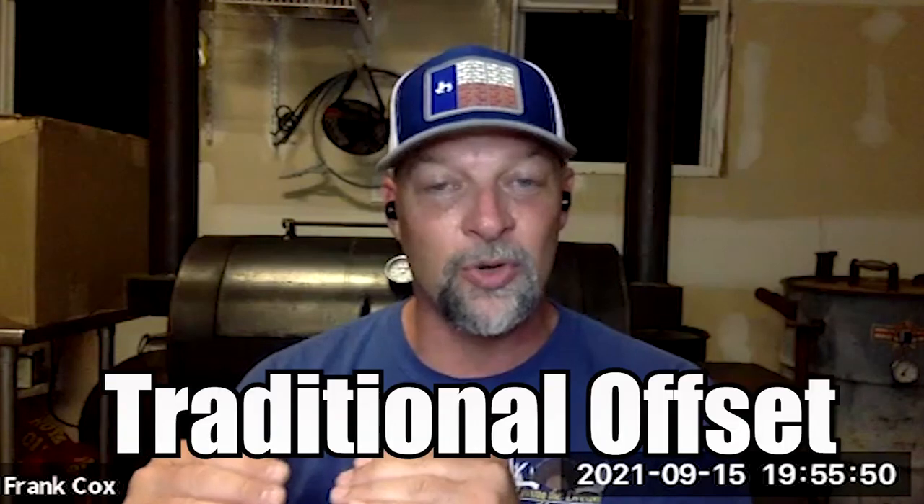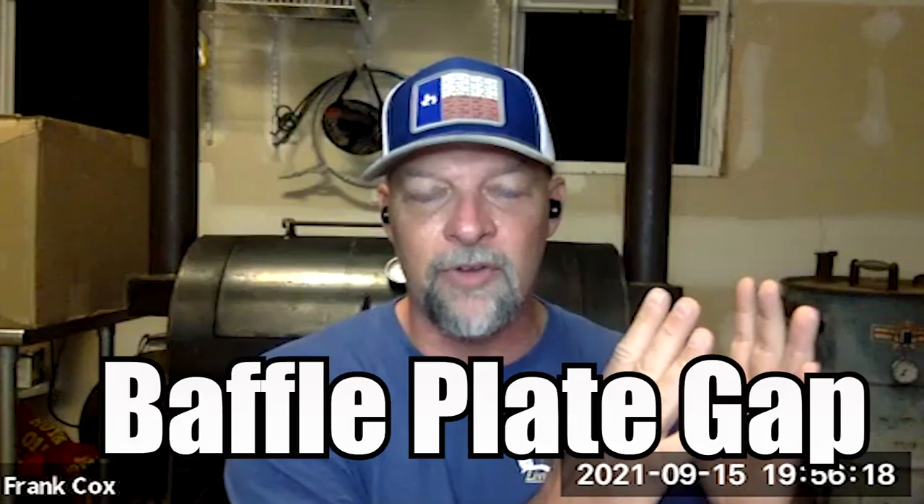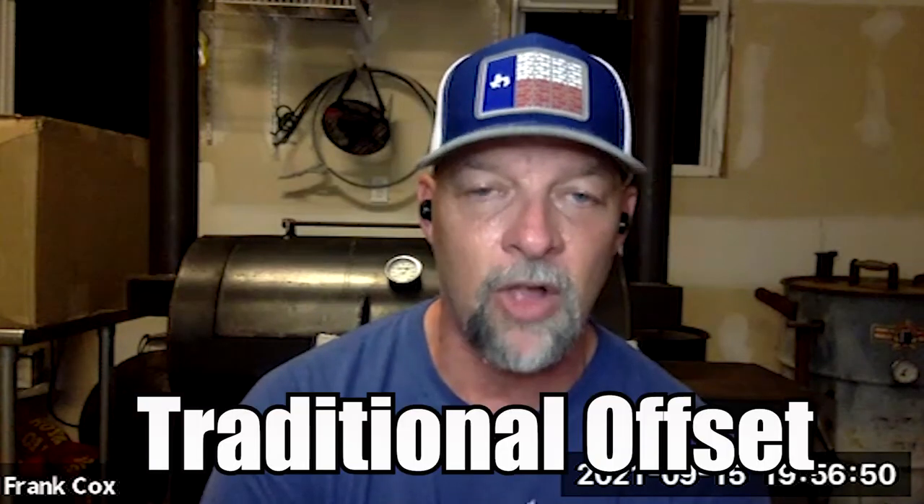In a traditional offset — there's open offset, which is what everybody's building right now, but there's old school traditional offset, which is a combination like the hybrid behind me. We're keeping that air mass below the cooking grate when it comes out of the throat, and we have tuning plates in there that are short. We take the full length of the reverse flow baffle plate, subtract about three inches depending on the size of your cooker for the baffle plate gap, then cut up the rest starting at a 12-inch piece down to a four-inch piece and stagger them in there with gaps between all those plates. You get this motion coming up — that's how the old-school builders built their cookers — and you get awesome flavor from those as well. I cook in this 20-40 behind me as a traditional offset most of the time.